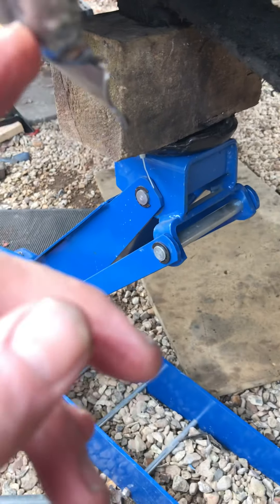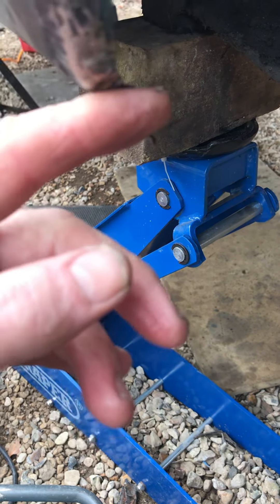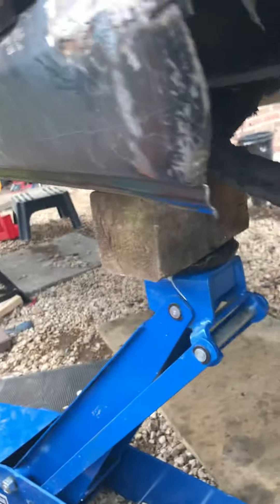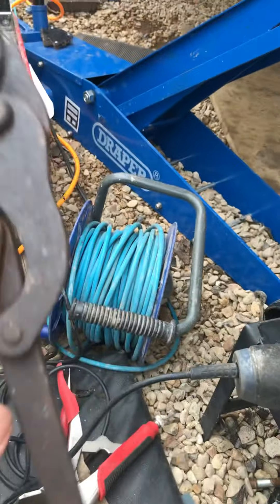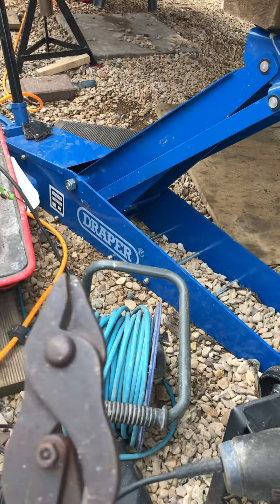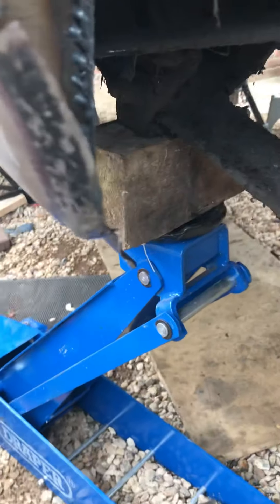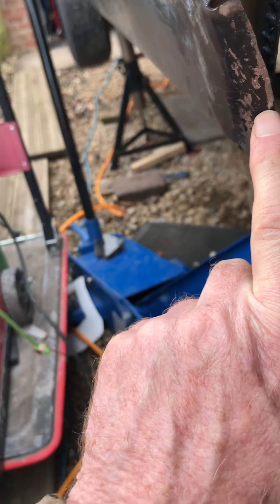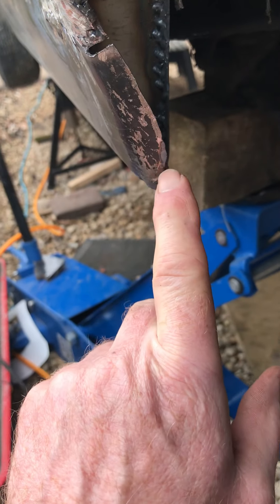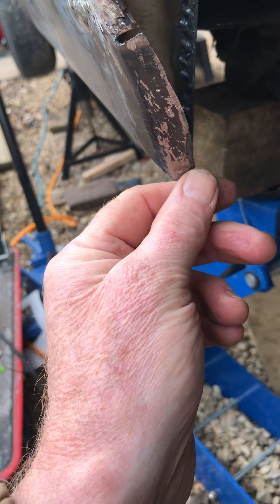Now when I got to the corner, you end up needing to somehow crease or shrink the metal here. I found in my tool collection — it's probably a wire cutter in fact — something similar to that. Using it, I crimped just down here, like crimping a beer bottle top, so I've just shrunk it around there, and that took up the slack.